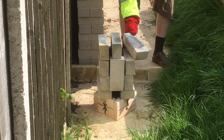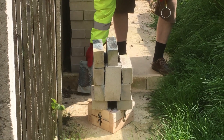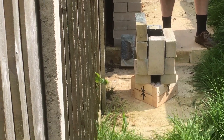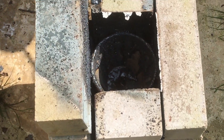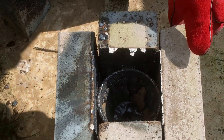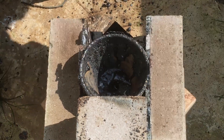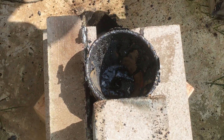There was a lot of iron splattering on the bricks. The reaction was very violent and probably most of the iron ends up being blown out of the reaction pot and into the air — very little goes downwards towards the mold. The amount of energy stored in the aluminum is enormous and it is a relatively small percentage of the total mix. Aluminum is far more reactive than iron and takes the oxygen from the iron oxide, turning it into iron and releasing a lot of heat in the process — a classic exothermic reaction. Miraculously, the clay pot didn't shatter, and that lulled me into a false sense of security and set me up for failure in the future.